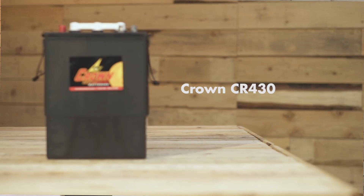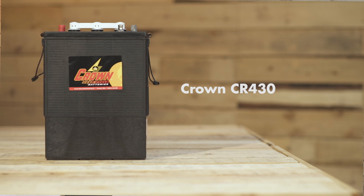There are two different types of lead acid batteries. The first type works extremely well in off-grid systems and is built to be cycled on a daily basis. They do breathe, so they do off-gas. Being that they're off-gassing, you will need to ventilate them properly and maintain them properly.